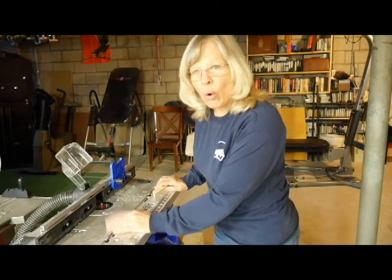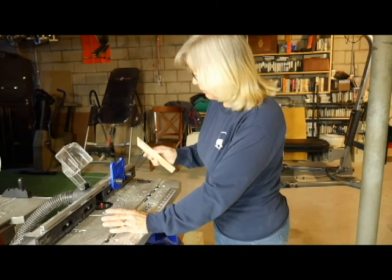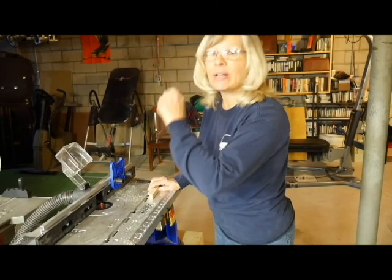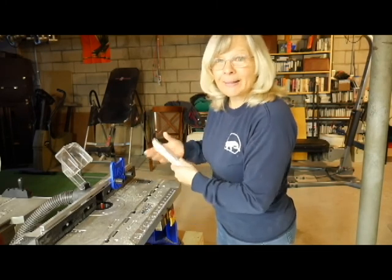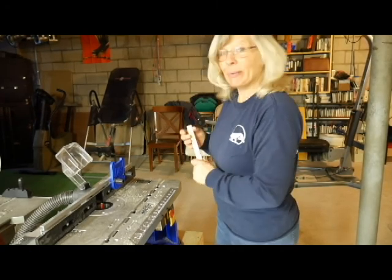However, I don't want to do the whole half an inch in one pass because it's too much for the router bit to handle. I'm going to do it in two passes — a quarter inch and then another quarter inch — so that it won't chew up my lovely frame that I just cut. So here we go.